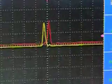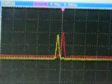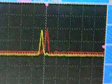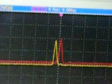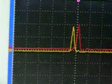Now as I raise the voltage, I just get a higher magnetic field off the coil, and a pulsating magnetic field. But that effect over there doesn't change. In other words, based upon the runtime parameters of this controller circuit and these SSR boards, you cannot get any more ringing to coincide with the pulse. Once you get there, you're done. It just starts oscillating itself.